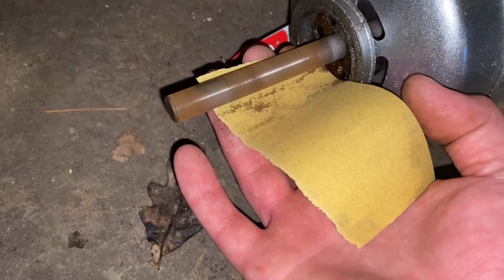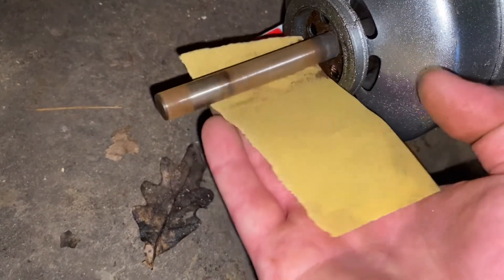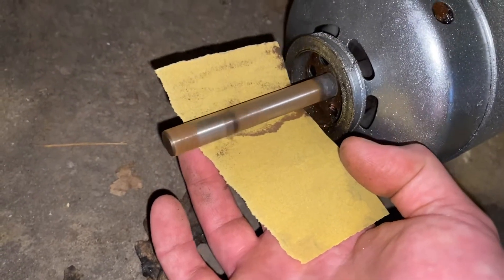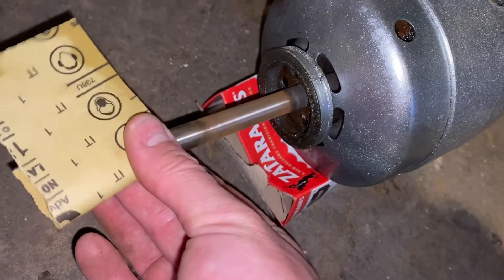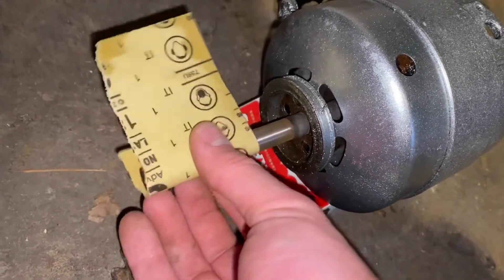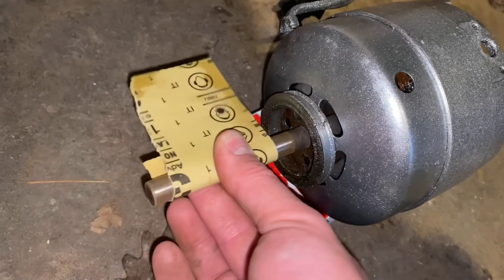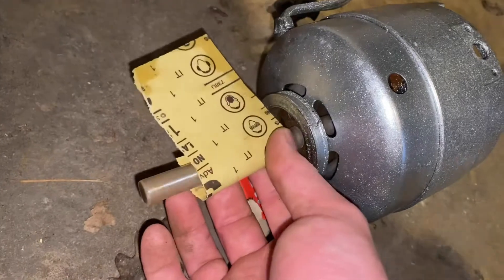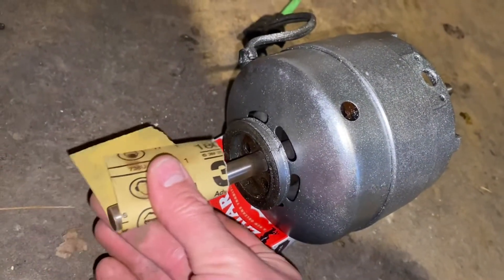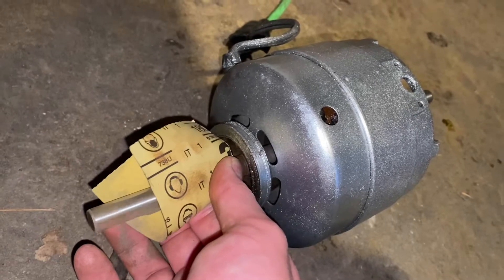You don't want to go overboard with it. You don't want to change the diameter of the spindle, but do leave it on to just take all the surface roughness off. Like I said, you don't want to put a lot of pressure on it. I'm using a 180 grit tape. You're trying to clean the surface area — you're not trying to make the thing any smaller.